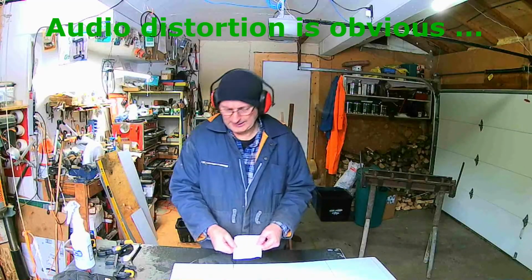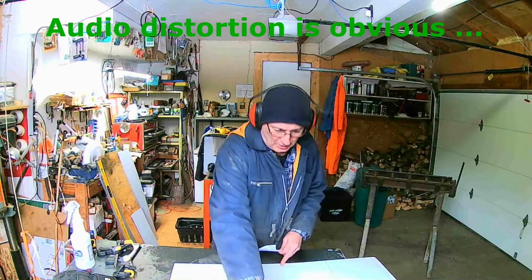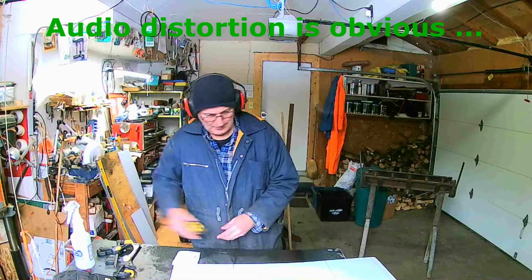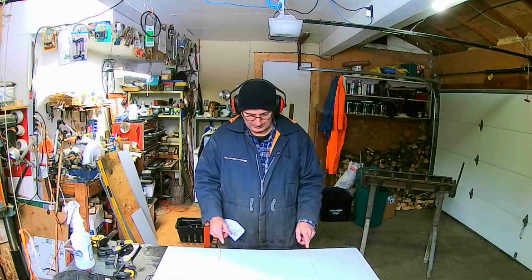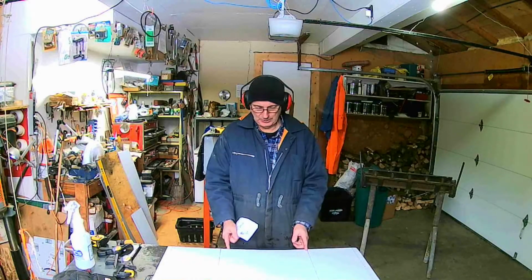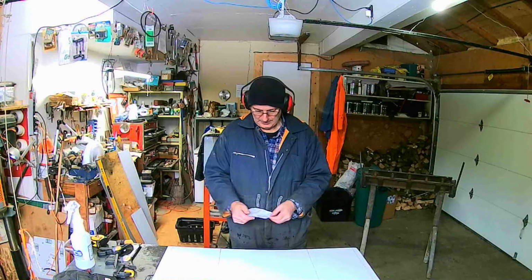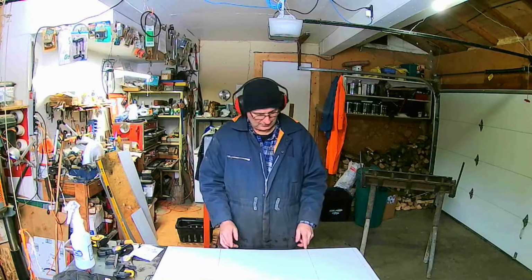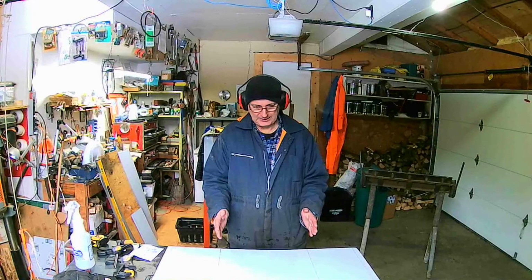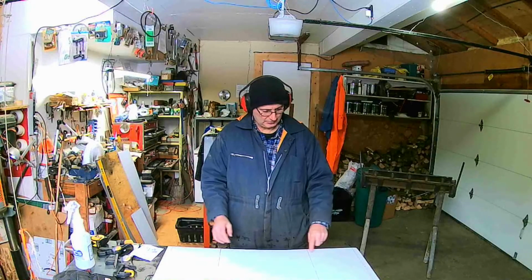Okay, according to my little diagram here, my buddy wanted a 21-inch long pan with a 16-inch width. So what he wants is 21 by 16 there, but he wants 17 at the top. So I'm going to have to put just a slight taper. I'm exaggerating it with my hands there, but we need a taper. So that's why I'm not going to bend these a full 90. We'll bend them just a little bit less. We're only talking about extending this an inch over a 9-inch depth.